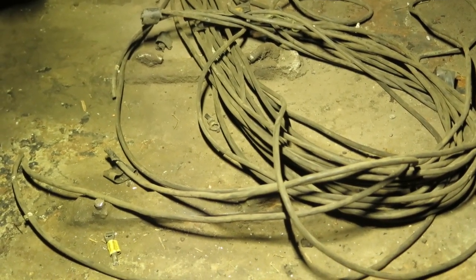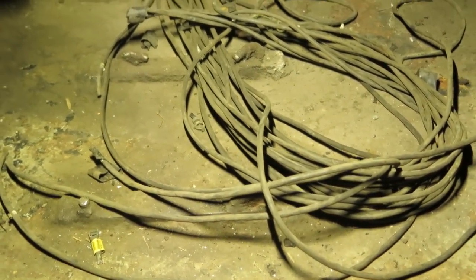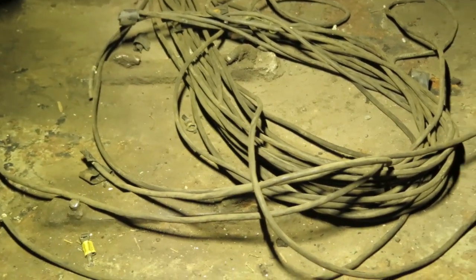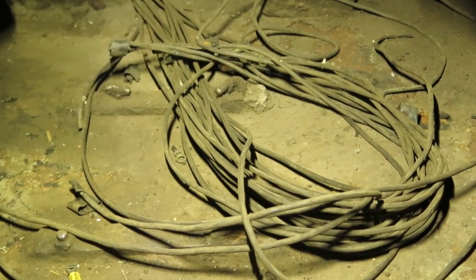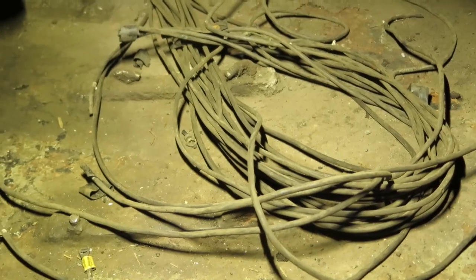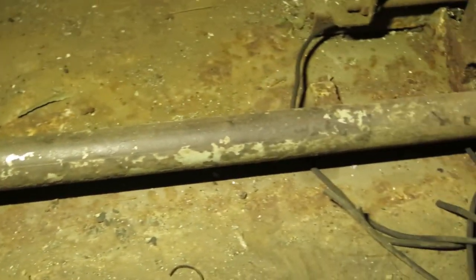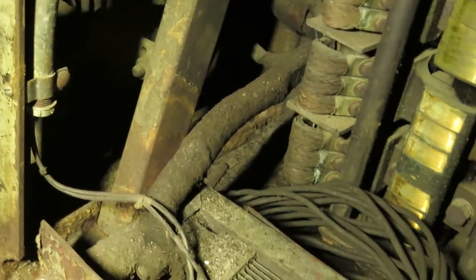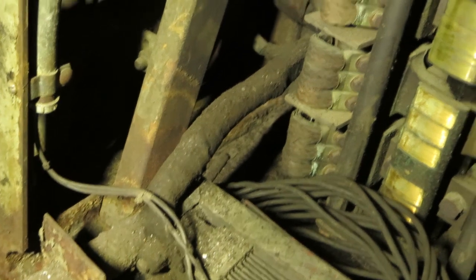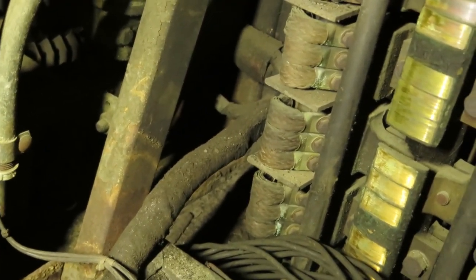You know, a little bit of moisture or somebody stepping on them, which we're going to do because it's a place where you have to work, is an invitation for trouble. So we had to get this corrected. This wiring goes to this piece of conduit across the cab floor, or under the cab floor, and into the electrical cabinet and to a terminal board on the other side.